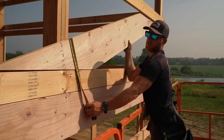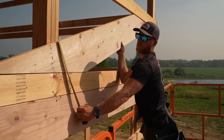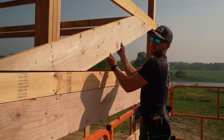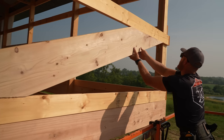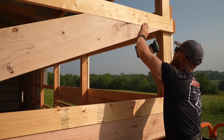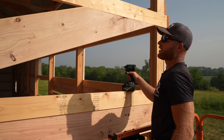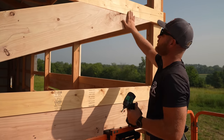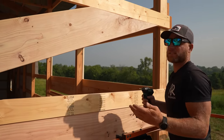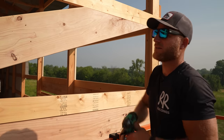If I move this out to about eight inches, by the time I go up on my sheathing on the roof with my steel at one inch, I'd say that's pretty good. We're not looking for anything super precise — it just needs to be here. I know you're probably going to think, 'Is this really your framing? There's nothing structural here.' Yeah, I mean there really isn't. I could add more structure if it makes you feel good. Sometimes I'll put a board behind here too because it's really hard to get this connected. All I'm doing is putting this here mainly to support a place to screw my steel to.